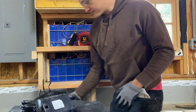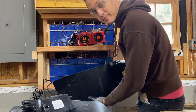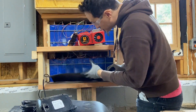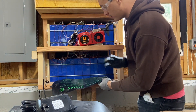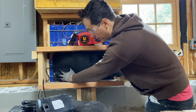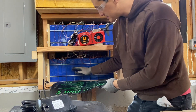Let's talk about the mats first. These are the mats. If you're doing an 8S or 16S LiFePO4 setup, these are almost perfect — look at how well they fit. These are 280 amp-hour EVE LiFePO4 cells, which are pretty much the standard. If you get LIITOKALA or whatever brand, they're all very similar. And if you're doing an 8S setup, the mat is almost the perfect size.